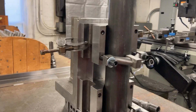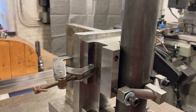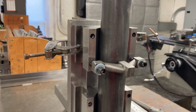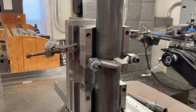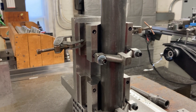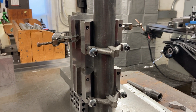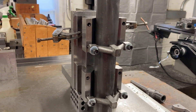So I got some nice V-blocks here — a nice matched set of them. Taft-Pierce. But I only have one set of clamps. I want to hold this with four clamps, not just two. I don't want to have to crank down super tight and rely on two of them when I change my setup and flip this thing around — I don't want anything moving. The blocks are kind of heavy, the material is kind of heavy, so I want nice equal pressure. I don't have four clamps, so we're going to make two clamps.